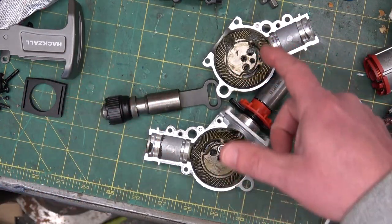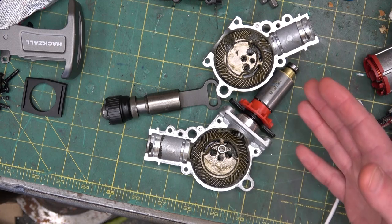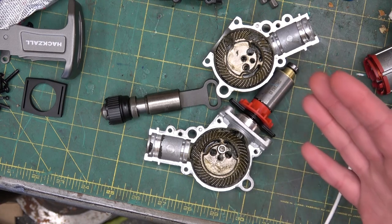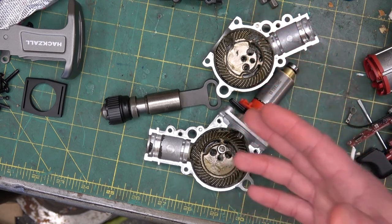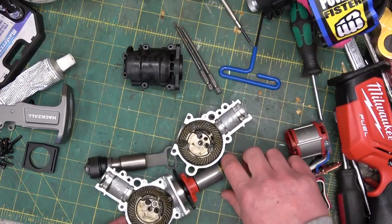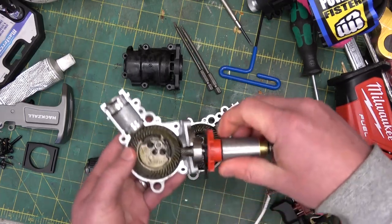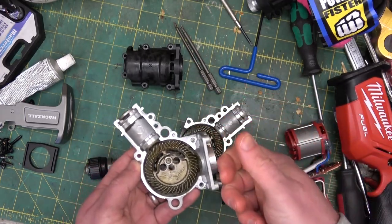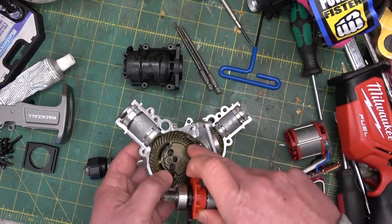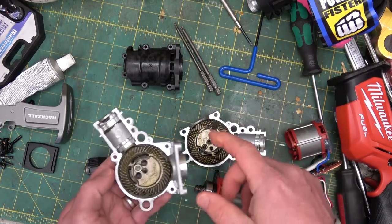Now in this case, we have two of these crown gears. What in the fuck for? Definitely not to increase the price, because anyone in tool manufacturing is not into increasing the price. So this has to be the cheapest slash easiest solution. What that allows you to do is positively locate that pinion — it's sandwiched in there. So if you stall this out, if you jam it hard or it falls or whatever, this pinion does not want to leap up and over and chew up these gear teeth, because it's sandwiched right in there.